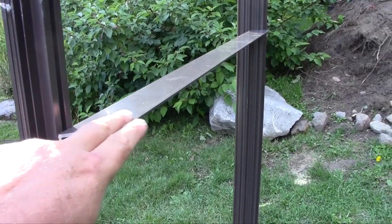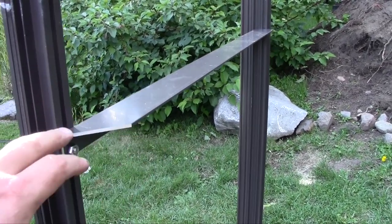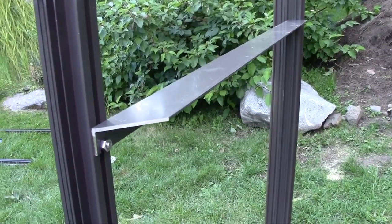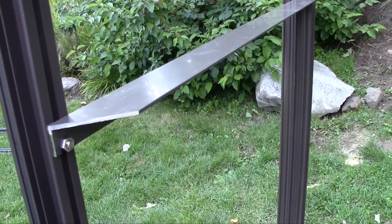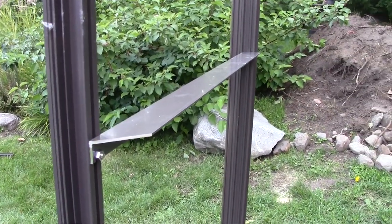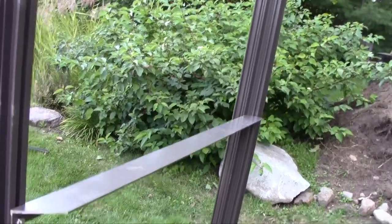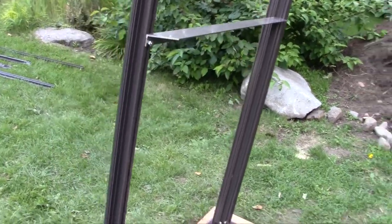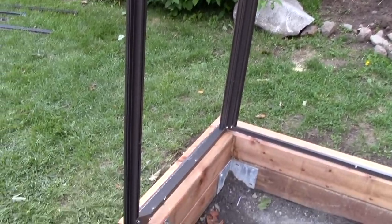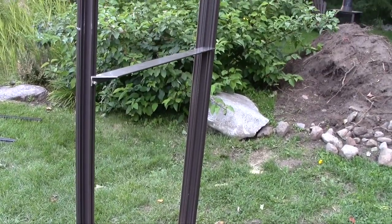You can notice that the braces on each side of the door have a notch with an angle, to protect from accidents if you get caught in a corner — it's more secure that way. I positioned the bracing at 38 inches and 5/8 inch, which is the recommended height in my specific drawing.